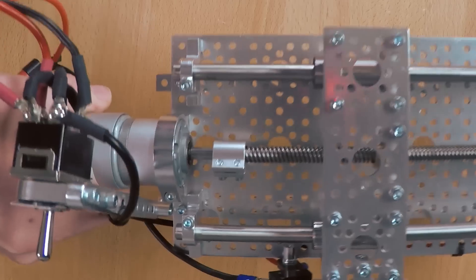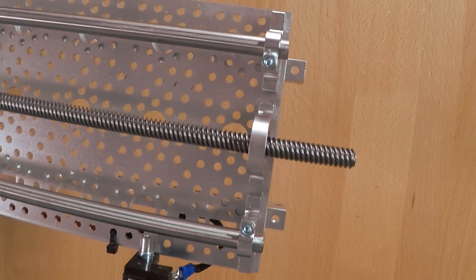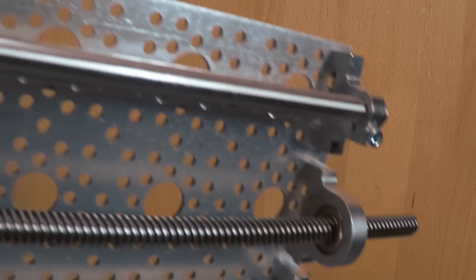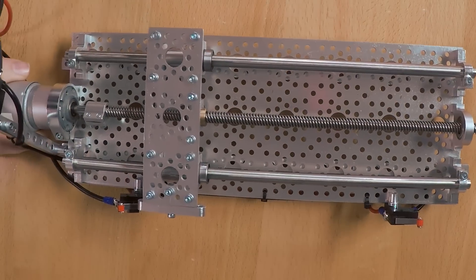We have clamping shaft couplers to make that coupling — in this case an 8mm to 6mm clamping shaft coupler. On the far side to hold that lead screw we have an 8mm bearing. Not all lead screws on the market are going to be precisely the correct diameter to run through a bearing — you may purchase an 8mm lead screw and find it's slightly oversized and won't fit through a bearing, so be very careful when selecting your parts. Also, a lead screw is going to work a lot better for you than a threaded rod, and we've created an entire video specifically comparing and contrasting those two — check the description below for the link.